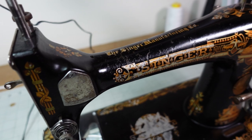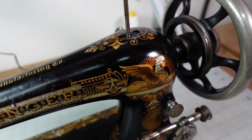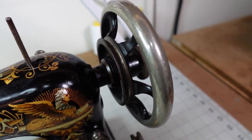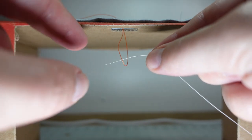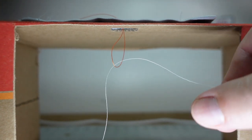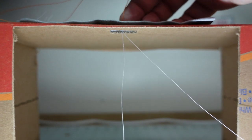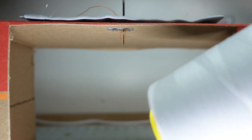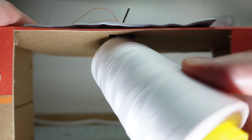Here's a machine from the 1800s whose design is not too different from what we have today. The inventors of the 1800s were trying to build a machine that could reliably and repeatedly produce a lock stitch. What's a lock stitch? That's a stitch where the upper thread comes down and around the lower thread and they lock each other in the fabric. This process repeats over and over until you're done with a seam. You can't have large spools of thread going around each other at 900 times a minute, so let's see how they figured this out.